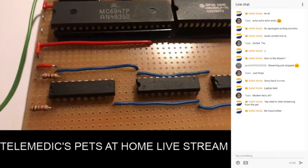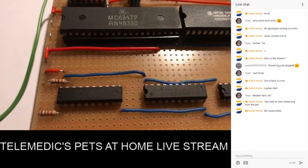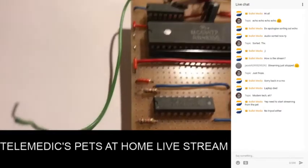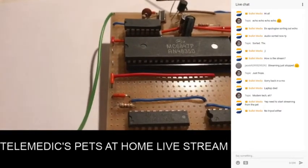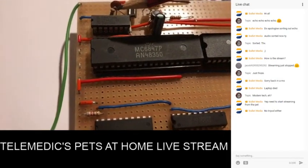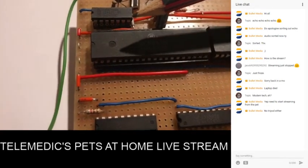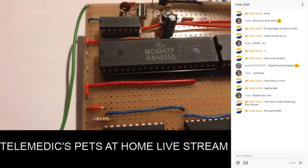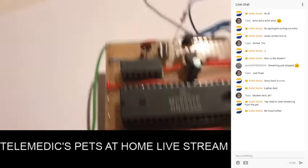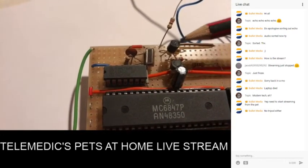Now the problem I had with this device was when I was trying to get this sorted to my little oscillator here. The oscillator chip here had a problem. I'd wired it wrong. These things happen when you're experimenting. It was actually giving out the wrong frequencies, and I couldn't get the telly to sync. And I'd also got this little amplifier connected slightly wrong, and we had inverted the video out.